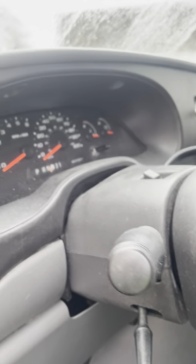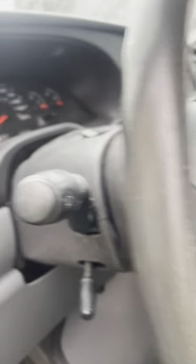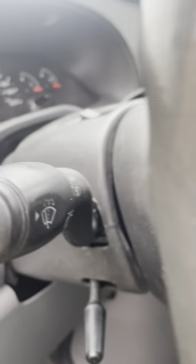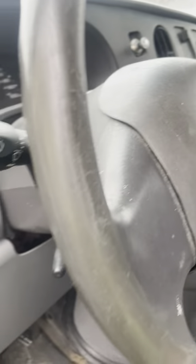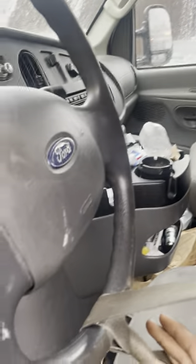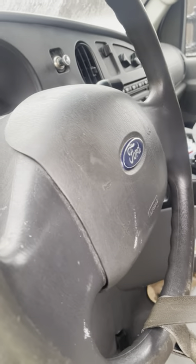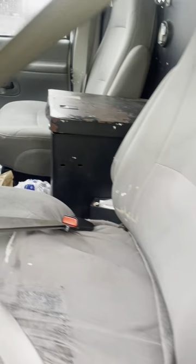So just look out for that. And if you are towing a car like that, which is the wrong way anyway — you shouldn't be towing like that, you should use dollies. It's worst case scenario when you're using a self loader. But worst case scenario, just always keep the car running. Make sure the car stays running, and then just do under 40 and creep it to your destination. That's like worst case scenario if you didn't have dollies or if your dollies broke. But that's the tutorial on how to pick up a box truck or a rear wheel drive car in a self loader.